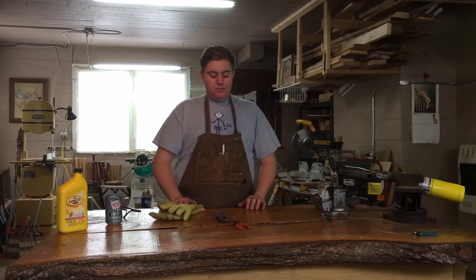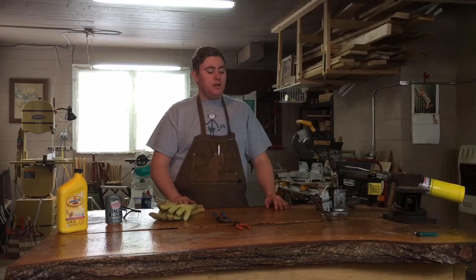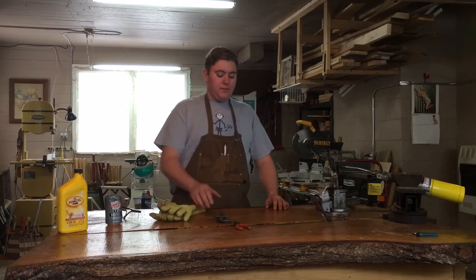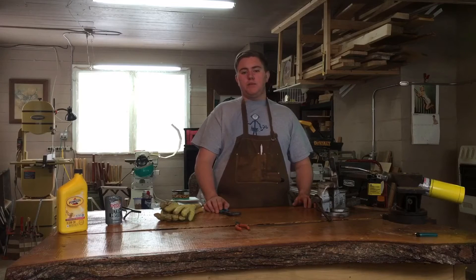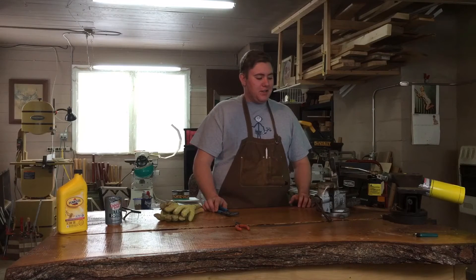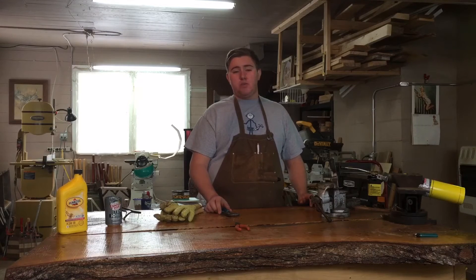To do this, you're going to need a piece of metal. I'm using a piece of a bracket I found lying around — I wire brushed it off, got it cleaned up, and it's ready to heat and quench. You'll also need your oil container. I have a couple of clamps holding the metal because the heat needs to be on it for a while to get it really hot — I don't feel like holding the torch for half an hour. I have my torch with duct tape over the trigger, and I'm using MAP gas rather than propane because MAP gas burns hotter.